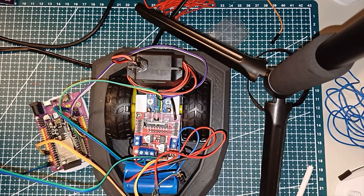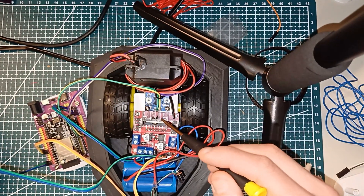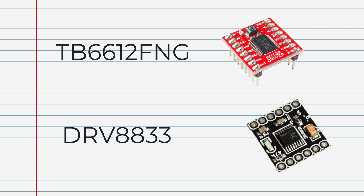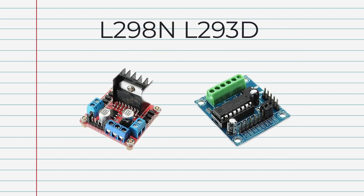Speaking of the motor controller — don't use the L298N unless you absolutely have no other choice. It's a very old, power-inefficient chip which loses a lot of voltage, meaning that if you have a 7.4-volt battery, you will only get around 5 volts for the motors. The voltage drop is more significant at higher voltages. I found two alternatives — you can see the chip names on screen. Having said that, if you really don't care about efficiency, L298N or L293D are very cheap, quite reliable, and have a lot of resources around them to help if you're just starting out with motor drivers.